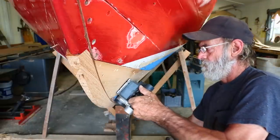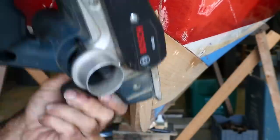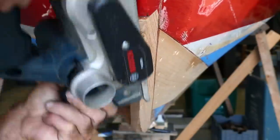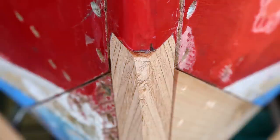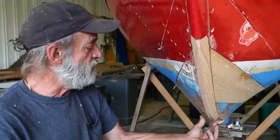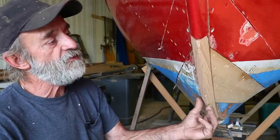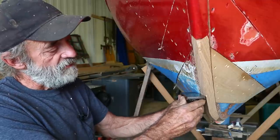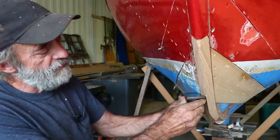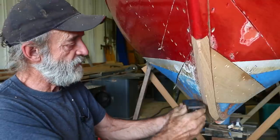I can actually feel the shape of it underneath the planer as I go along. As I get closer I'm going to give up the electric plane because I've got it down very, very close. It's the tiniest bit proud just at the edge of the rabbet here and maybe down at the heel a little tiny bit. I'm going to pick up a block plane — it's almost a very nice continuation of the fairness of the planking off the garboard and off the broad strake.